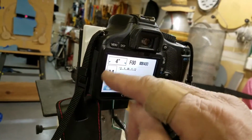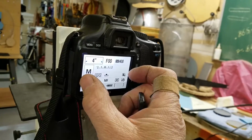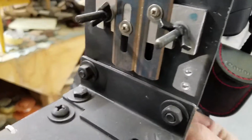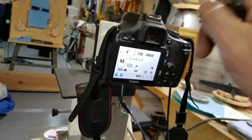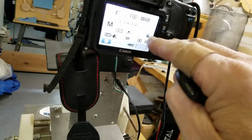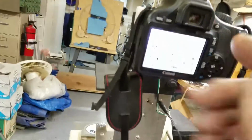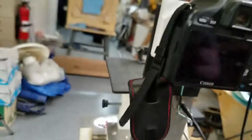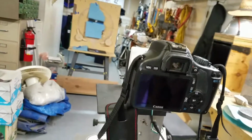At that point, I want to make sure that the slits on here are all lined up across level and that they fill up almost the whole screen. Also, if the slit here is not plumb, there's the slit. Yeah, I got my laser on. And there's the slit. You see the slit there? Okay. It needs to be plumb. And if it isn't, when you take your test exposure, if the camera and the mask are not level with each other, then they'll have a tilt, and you make them so that they're perfectly going across. The bottom of the slits are all level. And then you make sure that the slits don't have like a tilt to them. That would be the case if the slit was not plumb. So the slit's plumb, the camera's level, and the mask is level, it should all work out.